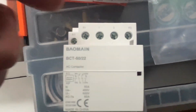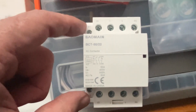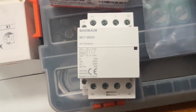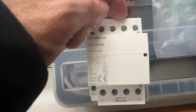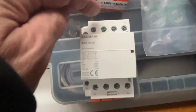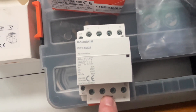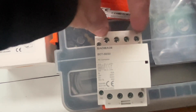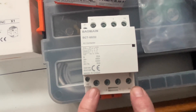Here's how it works: you've got two normally open contacts, two normally closed contacts, and two coil contacts. When you energize the coil it pulls the contactor down and makes the normally open contacts. So whenever the boat is plugged into shore power, it pulls in and activates AC from shore to go to my outlet. When I disconnect from shore power, the contactor drops out.